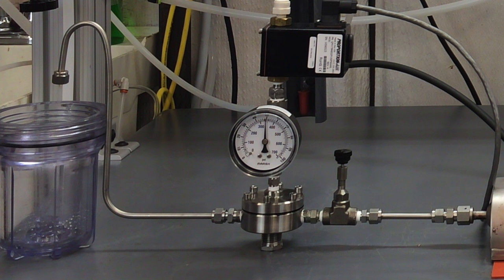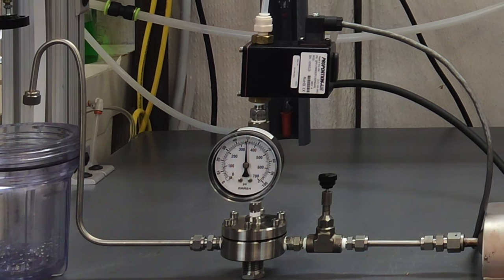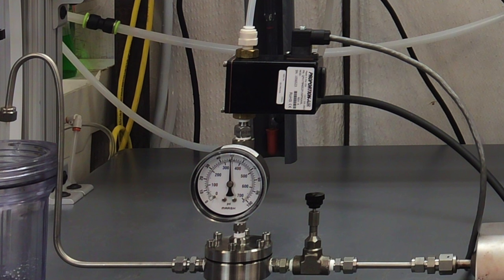Equilibar back pressure regulators control their inlet pressure to be exactly the same as the air pilot pressure on their domes. Because there is no friction or hysteresis, Equilibar back pressure regulators respond to pressure changes as small as 1 part in 10,000. We are using a QPV electronic pressure regulator to supply the variable air pilot pressure to the Equilibar back pressure regulator. Like the Equilibar, the QPV is a high-resolution device capable of resolving air pressure to 1 part in 10,000 as well.